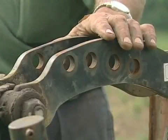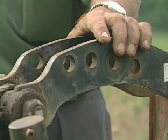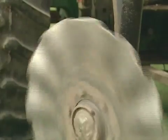These parallel linkages are rejects from the commercial zone builder that I had — I changed it a little bit and had two of these left over. They can be purchased from the company that built the zone builder. We made the brackets, put them on here, and then I just steal these 13-wave coulters from the commercial zone builder. I put them on here when I'm doing strawberries, and take them off and put them back on that machine when I'm doing my other work. I did not buy these — you could, but it doesn't take very long to change them.